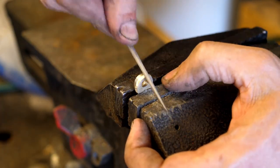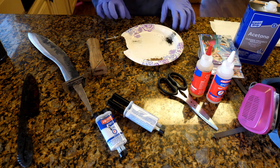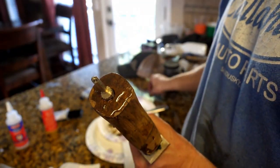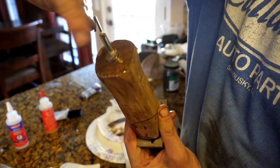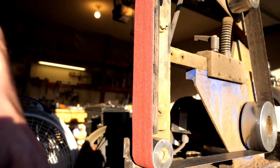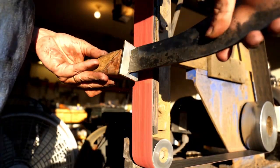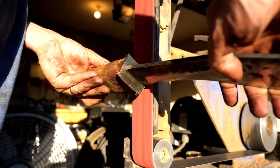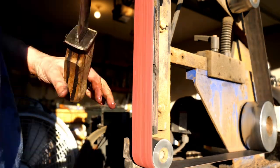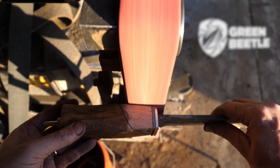After filing a very simple pattern into the nickel-silver pommel piece I've drilled and shaped, it's time to glue things up. But I make the epic mistake of using five-minute epoxy for this — it always burns me. It really puts me in a rush, and even though everything is dry-fit prior to gluing, if there's a problem during the actual gluing I really have not much chance to fix it. You really cannot clean this epoxy out of all the nooks and crannies through tang handles. 15 to 20-minute epoxy is pretty much the rule here.